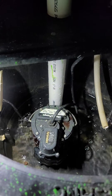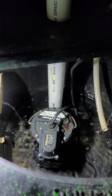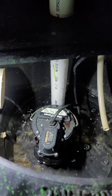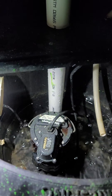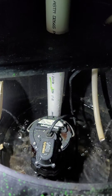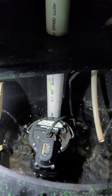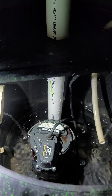So I did some research and found a device at Lowe's which is a quiet check valve. To give a little background, my pump does pump up about six feet and then roughly 20 feet across my basement, so it's pumping quite a distance. Because it's pumping up so high, that's what caused the issue.